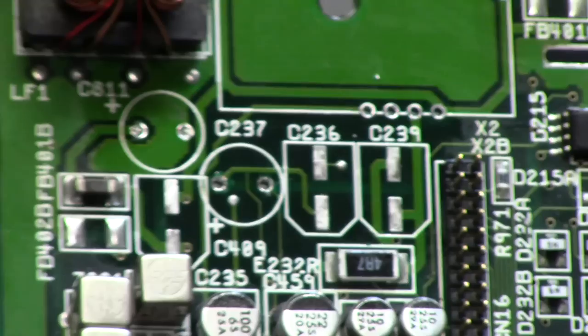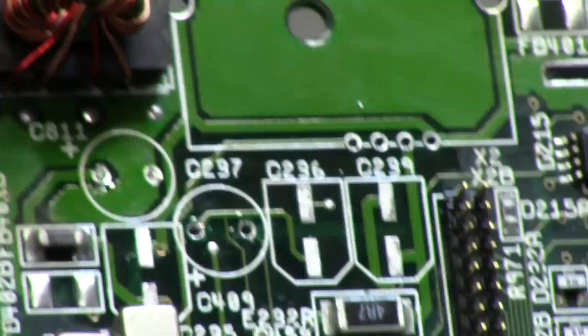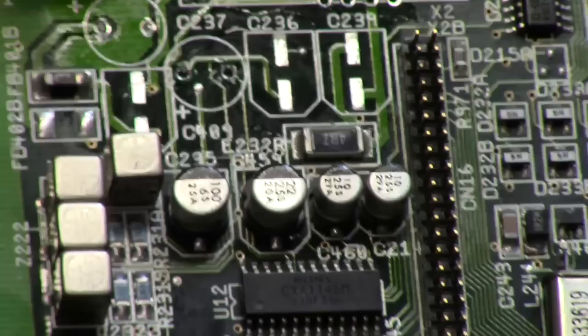Three SMD pads, one, two, three. One through hole. Got to do these two still because they didn't come clean, that one and that one. Pseudo clean, but the pads, perfect. I'm going to continue with the four caps underneath of them, next to the cans.